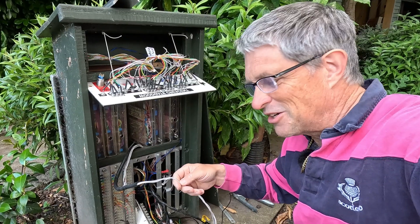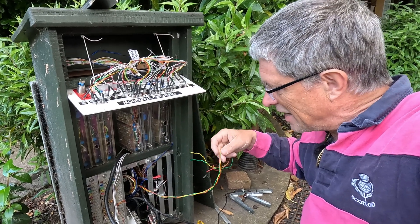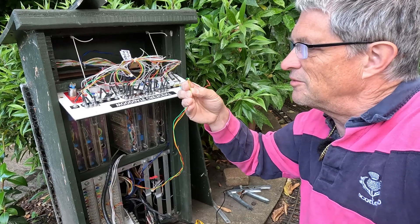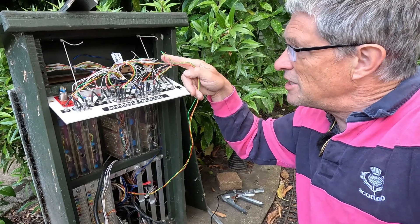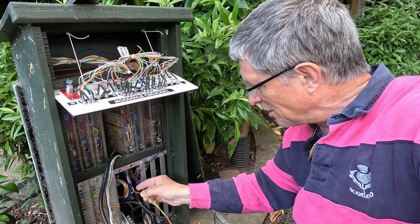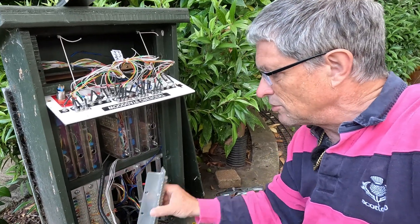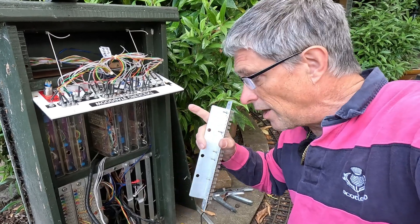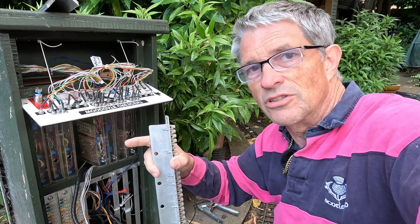So they're kind of easy to put in to start off with. I've also got coming up from the panel the yellow, red and green wires. The power is separate, so I've got to separate them, but they go from the mimic panel down through the little bundle - but not directly to the module. They connect back to the connector strip, and the set of them go back to the module as well as connecting up to the bundle that goes out to trackside to the signals along the track.